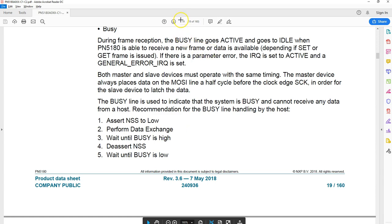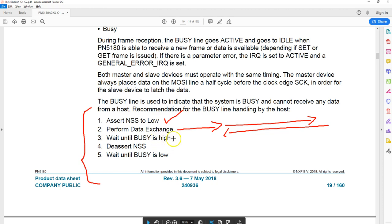Further down in page number 19, this is the most important thing you have to understand. This is how the SPI communication has to be done. The first step is you have to assert the NSS low. This is kind of a chip select. Then you perform the data transfer, whether you send the data to the chip or read the response from the chip. Then you wait for the busy line to go high, and after that you deassert or deactivate the NSS line. Then again wait for the busy line to go low. These 5 steps are so important. We're going to see how this is implemented in Arduino in my next video.